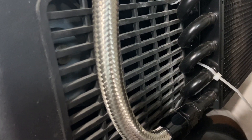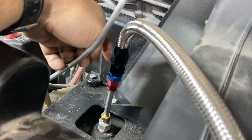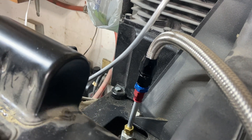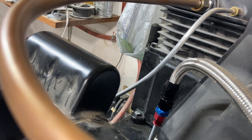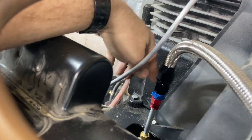Again, I've got more than enough copper coil and you can use that just as easily — you just want to get a couple more of the JIC compression fittings. But this hose had female swivel fittings on either end — dash-8 AN — and those swivel until tight. Then the other end goes straight down into the tank with another adapter: a dash-8 AN male flare fitting to a three-eighths compression sleeve fitting, and then a three-eighths OD tube and another three-eighths compression fitting for the compressor. Now, obviously other compressors may be slightly different, but what I did was just cut the bottom of the original transfer tube off. Ideally I would have saved the whole tube in case I want to put this back to spec, and then just got a little straight piece of three-eighths tube and one additional compression fitting — but I didn't really have the foresight to do that at first. So that's how I tied everything together, and that's basically it.